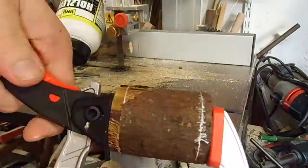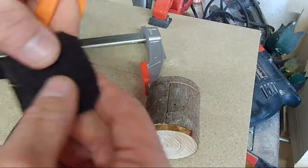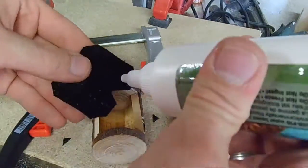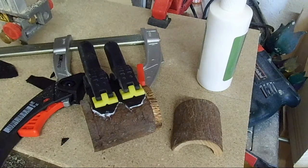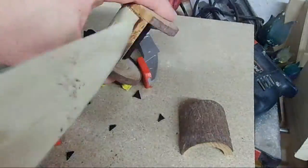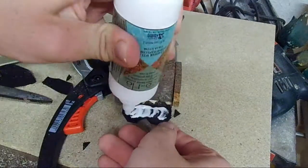After that, I inserted the lid just because. After the glue had set, I removed the packing tape from the lid. For a hinge, I cut off a piece of soft leather, cut it square based on the width of the lid, and added some decorative chamfers. To glue the hinge in place, I'm using leather weld — a leather glue that also glues wood, and in my experience it always has. I put it on the bottom side first, and after thinking clamps would do, I used painter's tape, and it worked well — except I accidentally glued the lid to the back flat surface of the inside of the chest, but I managed to pull it off. Once again I applied leather glue to the upper part of the hinge, put the lid in place, and clamped it using painter's tape.